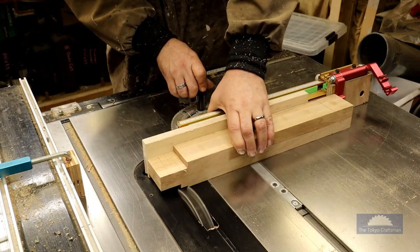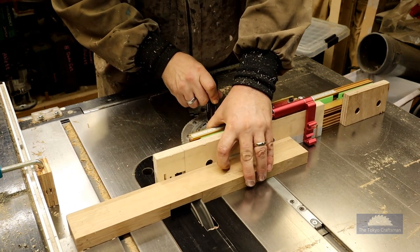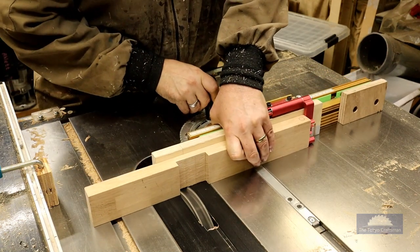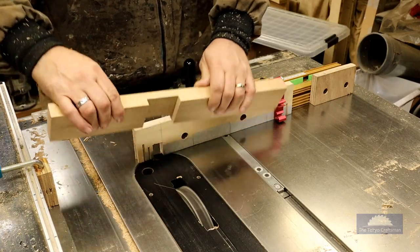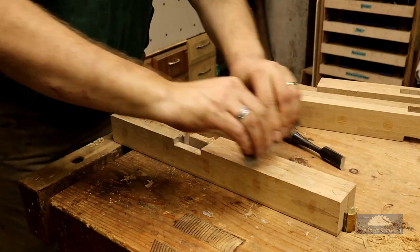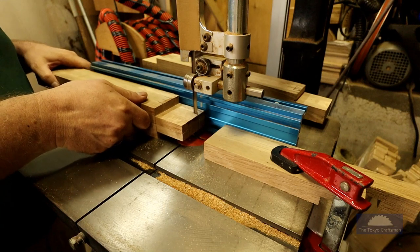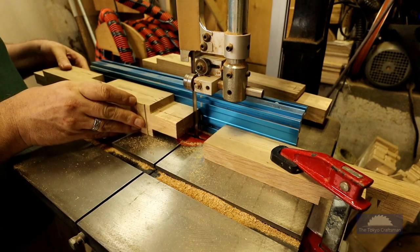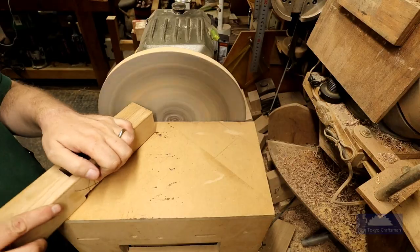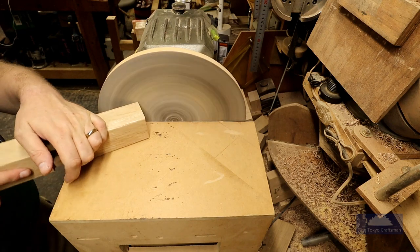Here I am doing the tenons, over and over. This is making the mortises. Here's the shoulder joint on the mortises. Cleaning up the glue. These are the legs that have the mortises and the shoulder mortising. Cutting the slots for the wedges — these would be wedge tenons. Rounding the corners of the legs over so they won't chip and will be a little nicer to handle. Easier to do this now than later.